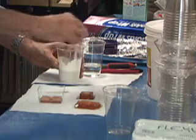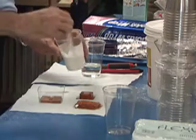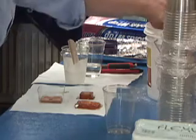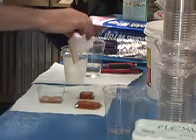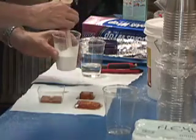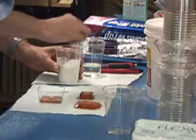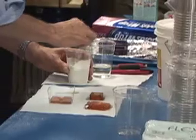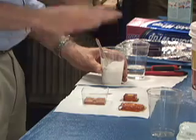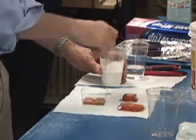It sets pretty fast, and it's exothermic — it releases heat when it sets. After about half an hour, the cup will be quite warm, and once it cools off, it's done. So it's about 45 minutes, and after about an hour it's fully set. The free surfaces won't look great, but the surfaces against the mold will exactly reproduce the structure of the mold.